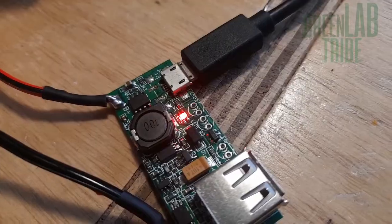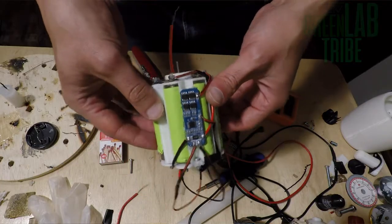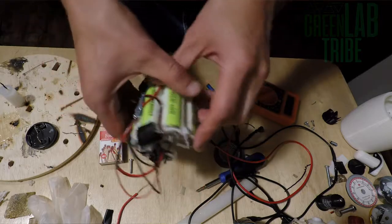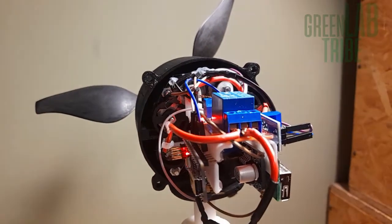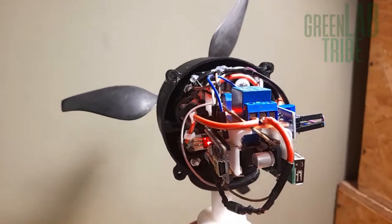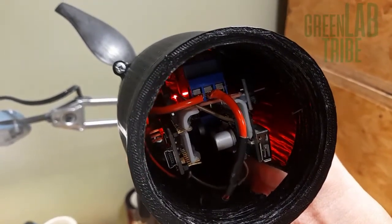This was for me the hardest part, by a lot. When it comes to electronics, my knowledge is limited and mostly theoretical. So I had to study a lot, test, and fry a lot of electronic modules. At the end, I designed a control unit using an Arduino Nano with a very basic approach: when the battery voltage reaches 4.2 volts, the generator is disconnected, and when it goes as low as 3.8 volts, the generator gets reconnected. There are no more protections beyond that.